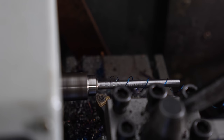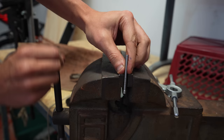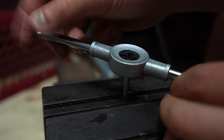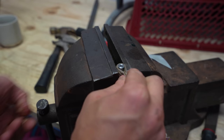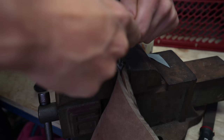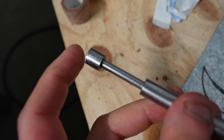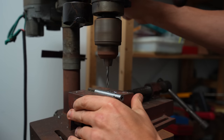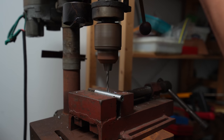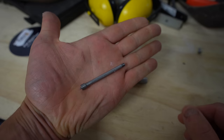Now comes the piston, which I'm going to make by turning down this piece until it fits into this hole. I think I've left enough of a rim here to stop the piston from firing out the end. So I used a little bit of lubricant and put a thread on the end of it. I also made a little end cap that will attach to the piston using the same size thread. Then I screw on this end piece, which will be making contact with the ball. Now the whole thing looks like this and moves around okay. Before I put the blank round in and give it a test go, there's something else I need to do - I need to put some exhaust holes in the barrel. This will make it look cooler but will also release gas and hopefully stop the piston from slamming into the end of the barrel too hard. So I just did that on the drill press.